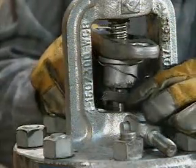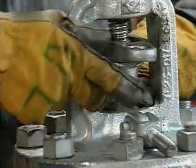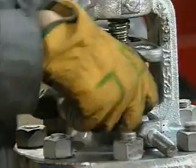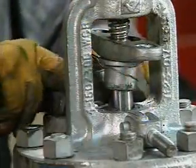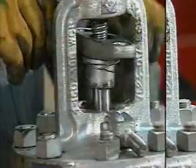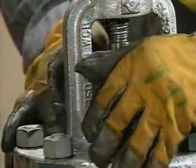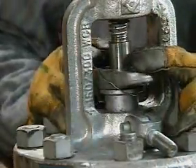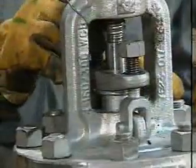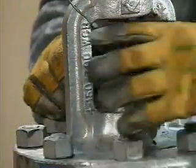The mechanic in our example is careful not to overpack the valve by putting too many packing rings into the stuffing box. The valve manufacturer's instructions usually indicate the correct number of rings that should be used. After all the rings of packing have been installed, the mechanic puts the gland follower over the stem and presses it into place. Next, he manually screws down the gland nuts until they are finger tight.